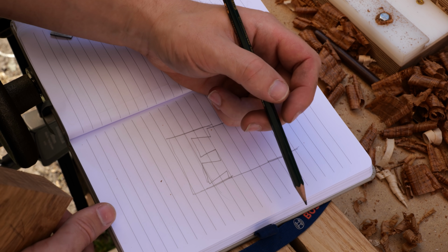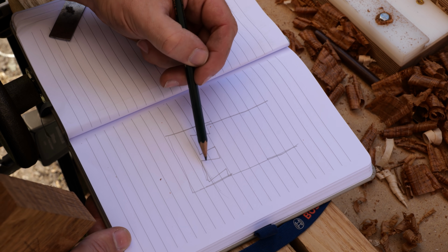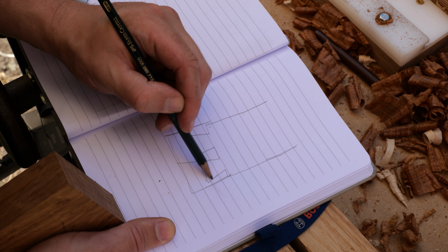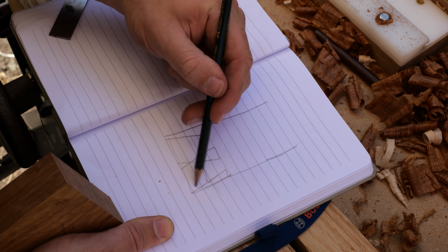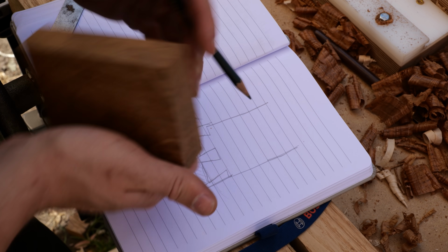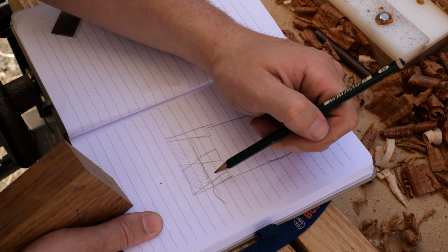But then it occurred to me, what if I don't bother cutting lap dovetails? I just lay them on top of this thicker material and instead just cut them all the way through as through dovetails, like that. So then all of this is just a big old socket, but the dovetail only goes in probably about halfway. And then when this is shaped away afterwards, it won't matter.